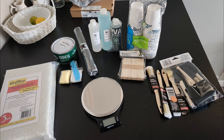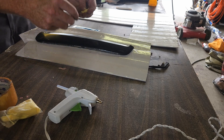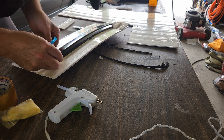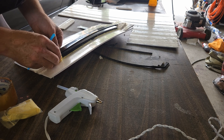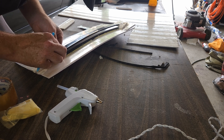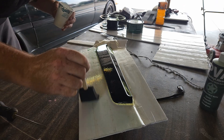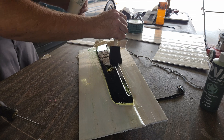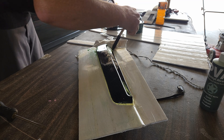I'll put some links down in the description for the materials I used. For my first attempt I used this foam signboard stuff and it didn't work out too well — zero out of ten, would not recommend. The foam board had a paper surface so I had to cover it with packing tape to make it so the gel coat wouldn't stick, but the biggest issue was heat-related problems from the exothermic reaction of the catalyst.